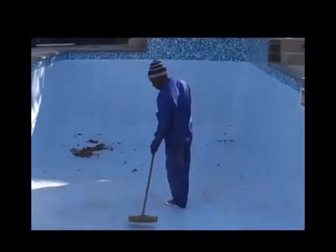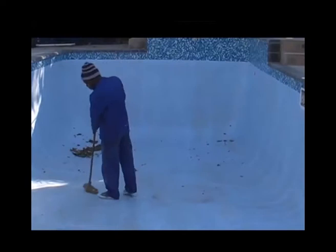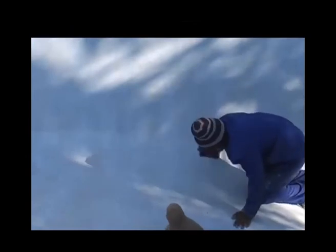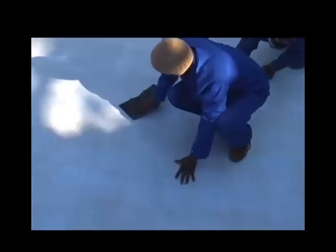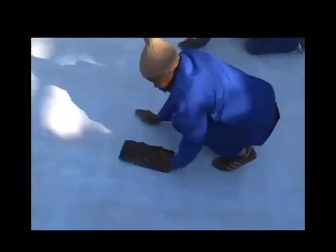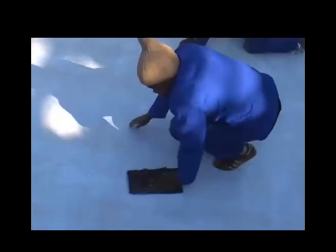That is the next day. The coating is now hard and set — a little bit glossy, still patchy. We can clean the pool now if there are leaves or rainwater. Then start with sanding of the whole surface. That is important: use 60 grit sandpaper to break the gloss. Just scratch it a bit to create a good mechanical bond for the next layer. This is the longer process where we left the coating to dry overnight.